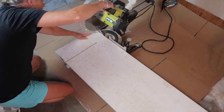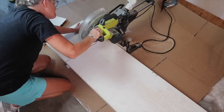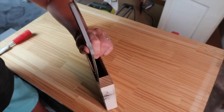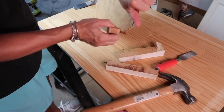I had to cut both ends of the doors because of the way the panels were laid out — I didn't want to cut a panel in half. The width of the doors was wider than my cutting range on my saw, so I just had to flip them over to continue my cut. I cut both bifold doors this way. The doors are hollow core, so I needed to make sure they were strong enough to sit on. I took the ends of the doors that I had cut off and removed the front and back panels, ending up with just a solid piece of wood.